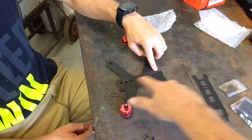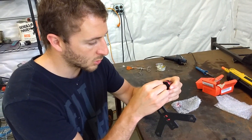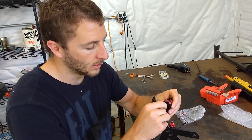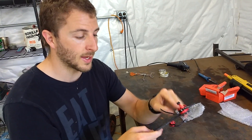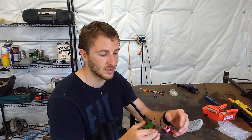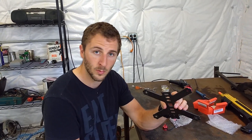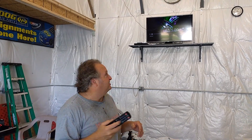This is the front of your frame. When you get these motors you'll get two types of screws - a longer one and a shorter one. In the video we're watching he says to use the shorter ones and put some Loctite on them. We don't have any Loctite at the moment so we'll snug them up now and take them out later to add Loctite, mainly because when you're flying there's a lot of torsion and direction switching, and if it wrecks you can knock them loose pretty easily.